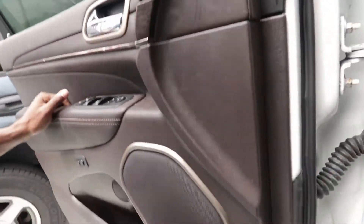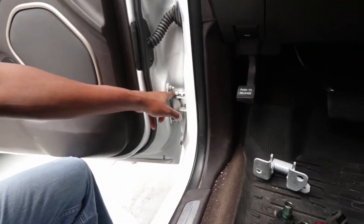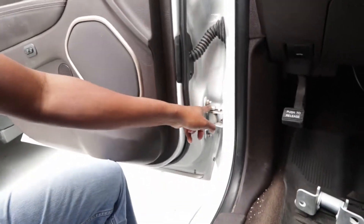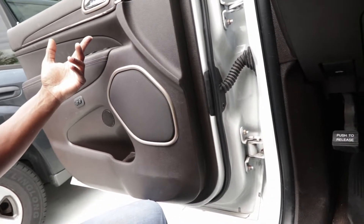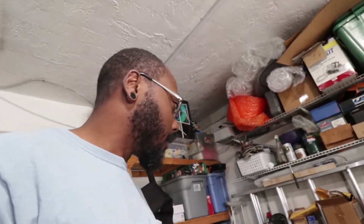The second thing you're going to need is probably a jack. If you're astute, you probably figured that if you remove this bracket, the only thing holding the door is going to be the top hinge. So what do you think is going to happen when you take that out and this 300-pound door is only supported by a single hinge? You're going to fold that hinge like a taco. So you can either get a couple of buddies to hold the door while you change that bracket, or grab a floor jack and probably a piece of cardboard so you don't mess up the bottom of the door. I usually have cardboard everywhere.